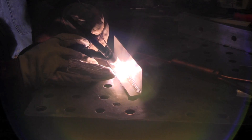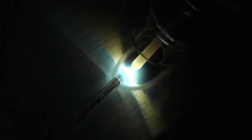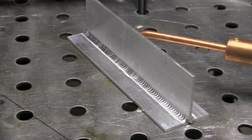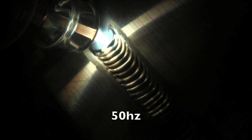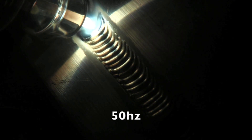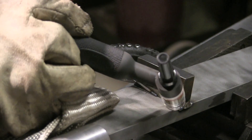Right now I've got it set to 250 Hz on AC, trying to really pinpoint the arc and keep the bead on this little fillet weld small. Here I'm using just a little bit low amperage, and here I cranked it up a little bit to make sure to get into that root. And it's also adjustable — here I've adjusted it down to 50 Hz if you want something to weld more like the old transformer machines.